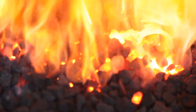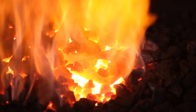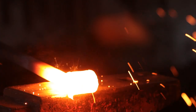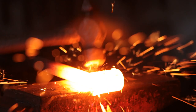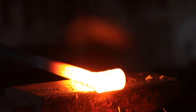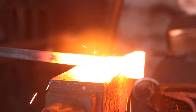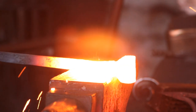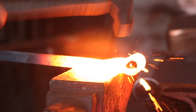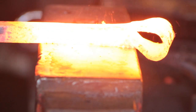In order to weld it, I will heat up the material under the coke whilst leaving the eye itself uncovered, and this prevents the eye from burning. I then weld with a light hammer — nice firm blows. The light hammer allows you to strike faster. I'm not actually using flux on this because I'm running a neutral fire; it's a lot quicker to work without flux. Do have a look at my scarf welding video for tips on fluxless welding if you haven't watched it yet.